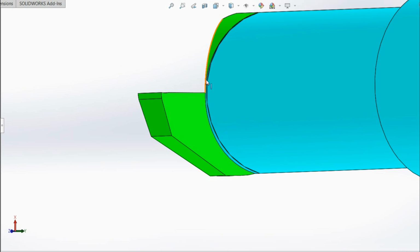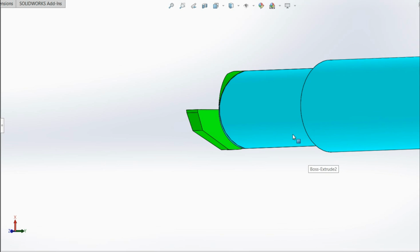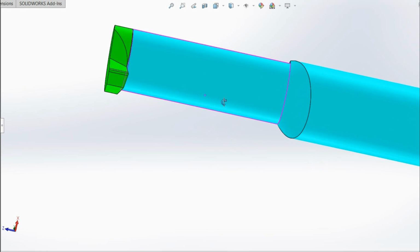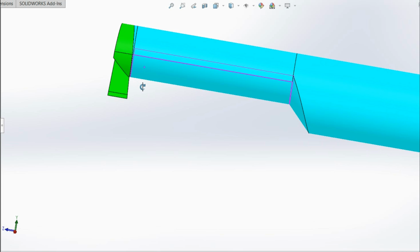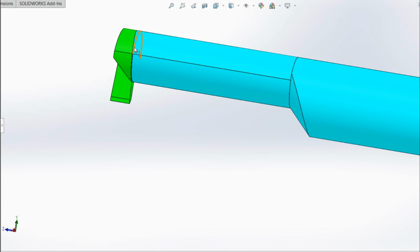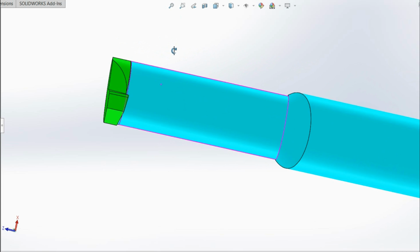If this was doing a huge diameter where this ran off this way, you could do your normal clearance and just a little cleanup here and you'd be good. This has to be good all the way around. So an easy way to do that is to actually grind this 3 degrees both directions, 3 degrees in the one way right here and 3 degrees this way.